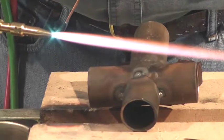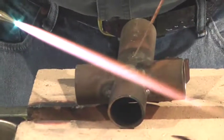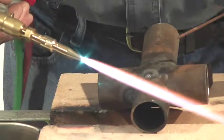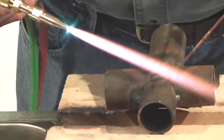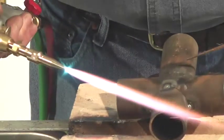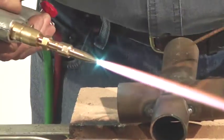With the number one tip, I'm running the flame out a little bit and using a three thirty-second steel rod. A lot of chrome moly rods are available at your welding supply house — different numbers from different companies, they all work great. Now if you're doing 063 wall — this is one-eighth inch, about 125 wall thickness — if you go down to 063 or less, you don't need much preheating at all.